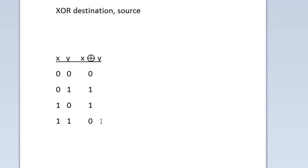Let's use an 8-bit binary value down here. Let's type in 8 ones. So 1, 2, 3, 4, 5, 6, 7, 8. We know this is 255. This is the decimal of 255, right? And the hexadecimal of FF. How do I know that?